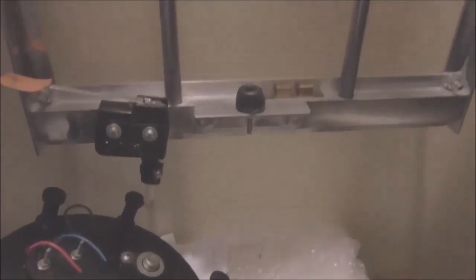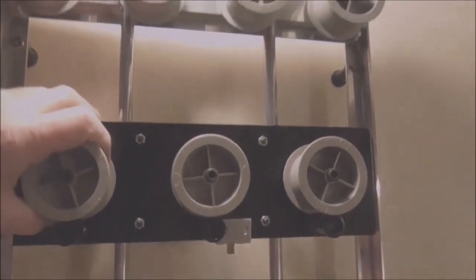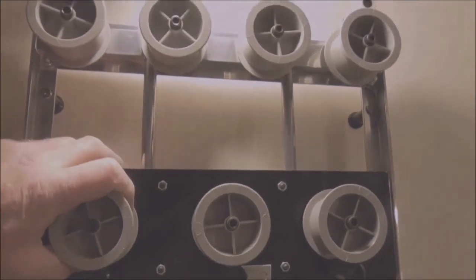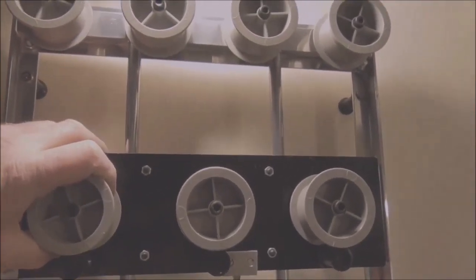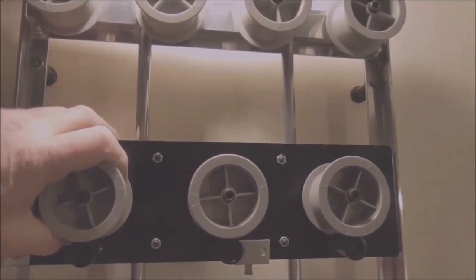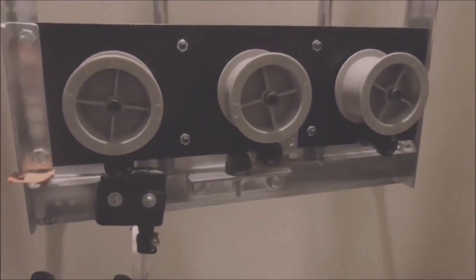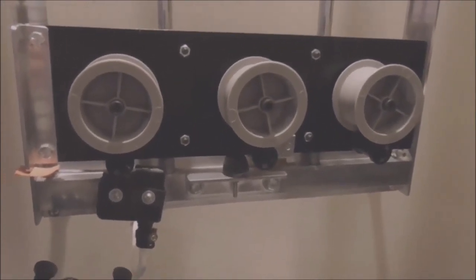The switch that is. The motor will start to run down. Projector will start slowing down. The accumulator effect of all the film around these rollers will be used to bring things to a halt, which finishes up about here, I think. Just latch it back in. That's it. So it takes a little bit of load to pull it out of the latch, but that's a great safety thing because you just don't know what the platter is going to do at times.